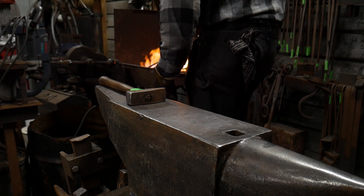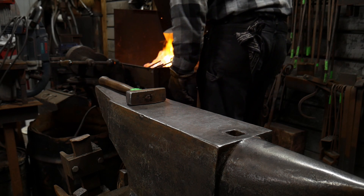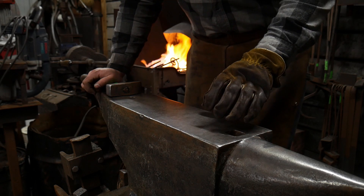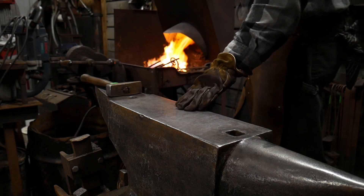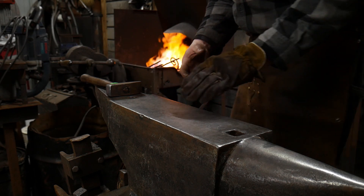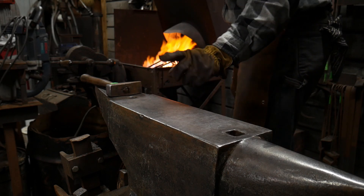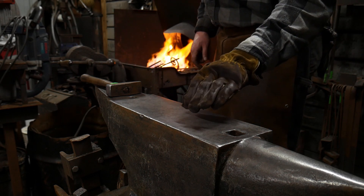Let's talk for a second about this welding heat and fire. Another thing you can do to get a good weld is to make sure you watch your airflow — that is going to inhibit your weld worse than anything. Your piece will never get any hotter than what your fire is, but putting more oxygen into the fire at those higher temperatures will burn your piece.